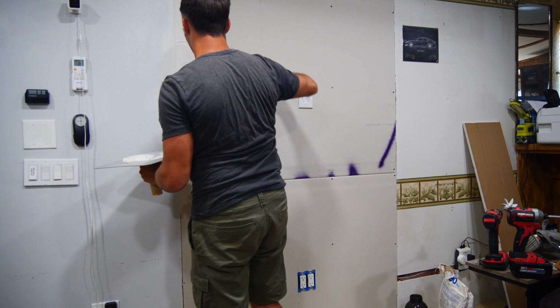I always opt to spray with a very fine spray pattern, as I don't really like the splotchy look that some people tend to enjoy. So, with the can shaken up and set to its finest setting, I just spray from side to side with a consistent motion, keeping my arm parallel to the wall, not twisting my wrist as I spray. If you twist away while spraying, you'll get a more splattered effect that's inconsistent.